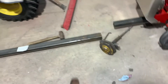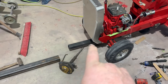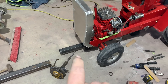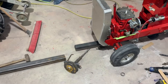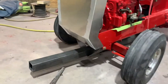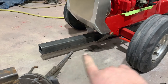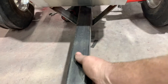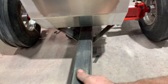I'm also fabricating a sliding weight bar underneath there. I got to get a different piece of tubing — I bought two-and-a-half-inch quarter-wall and it's just too big. I have a piece of two-inch right there, and I think a piece of inch-and-three-quarter would go inside it, but I may end up just using inch-and-a-half quarter-wall tubing — be plenty strong. I made the bracket fit the two-and-a-half-inch, but it's a little wide. What I'll probably do is zap that straight section out, fold it in until it touches, and then weld it out.